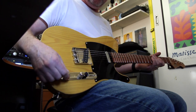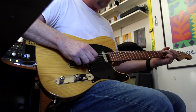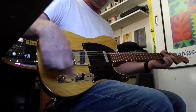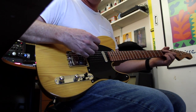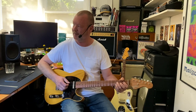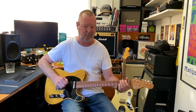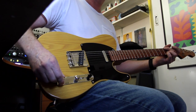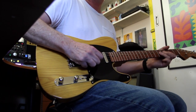There's a three-way switch with a series pull-out. Both pickups in series — if we go to the middle position, it's parallel. And when you need a little more fatness in whatever position you're in, just pop the knob up.